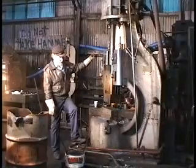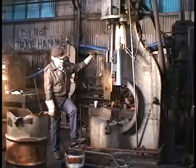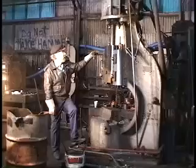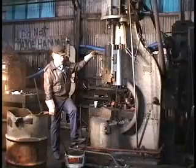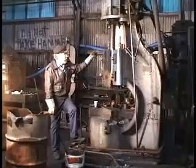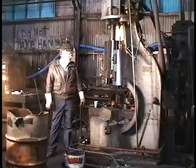I can give it more air and hit as hard as I want. I popped the throttle a little bit and then gave it down motion, and it smacks pretty good. That's not as hard as it's capable of. I hate to hit the dies together, regardless of what some people say.